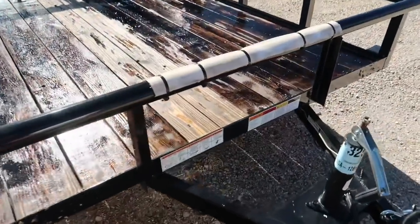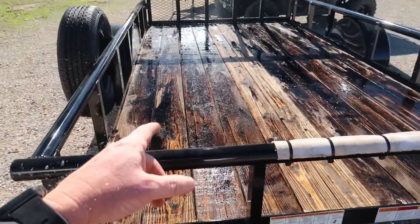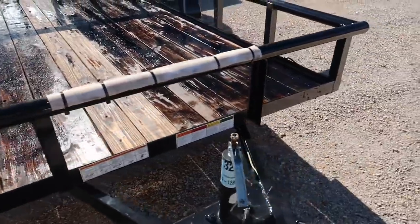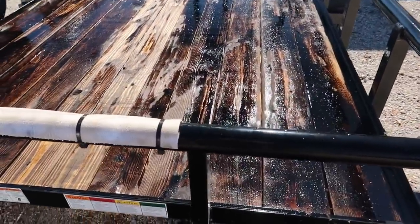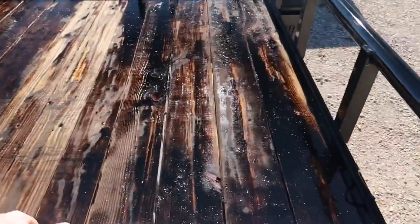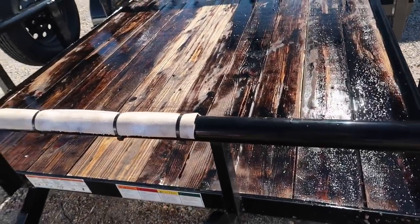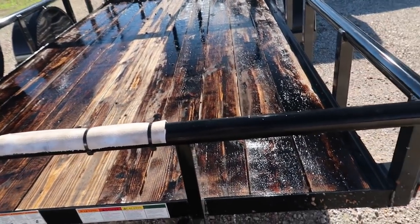So that's it. Put the fire hose up here on it, got it zip-tied to it. Just put a coat of burnt motor oil and diesel fuel. I get asked a lot about the ratio of that, what to do, what to use. It don't have to be exact or anything. I pretty much mix about 2 gallons of motor oil, about 1 gallon of diesel fuel.